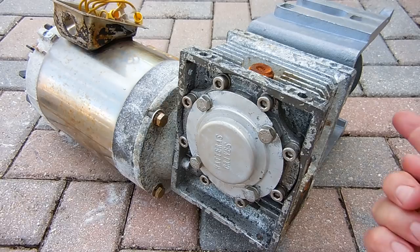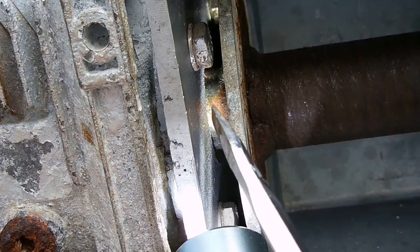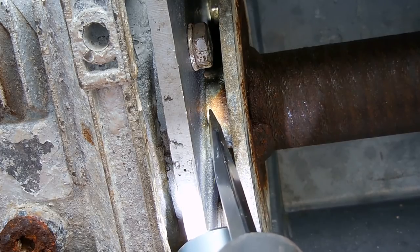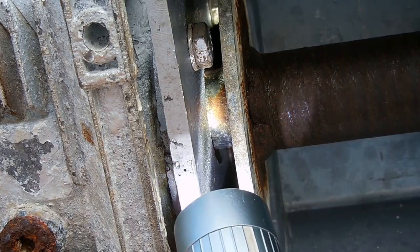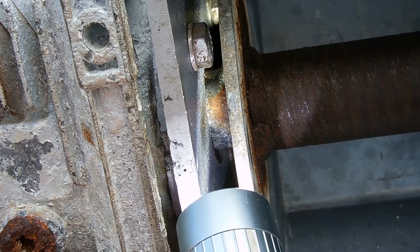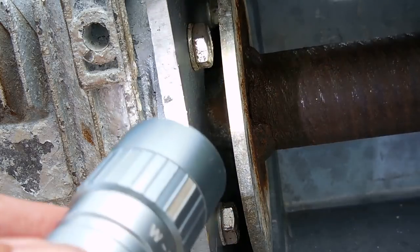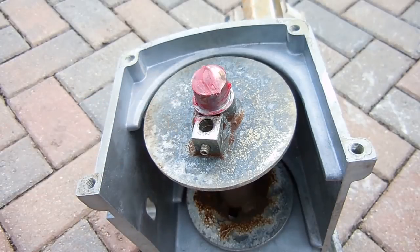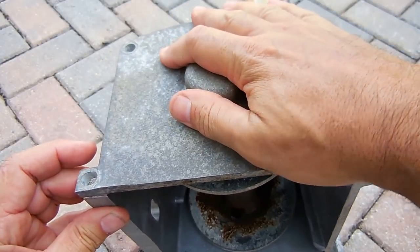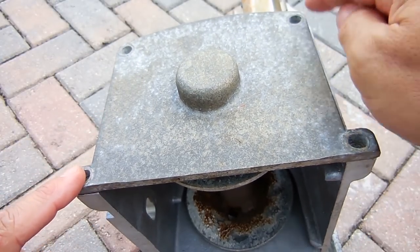The cover has been replaced on this end. Let me show you what it looks like when the shaft is fully seated. Right here, between the housing and the pulley, the shaft is larger in diameter and a little thinner where it slides inside the gearbox — when you look in here you should see the shaft is the same diameter going all the way in. When fully inserted there's enough space on the end of the shaft to put the retaining ring back. Now I'm putting the end cap on the housing — some waterproof marine grease has been applied to the shaft and the hole in the cover. It's totally down, perfect.